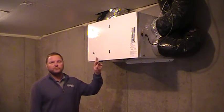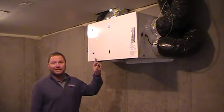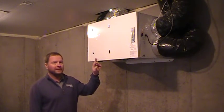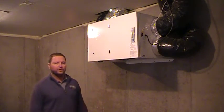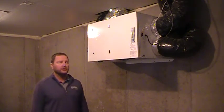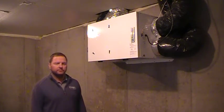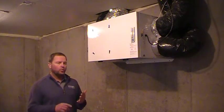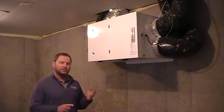This is the most important piece of equipment in your house — this is the lungs of your house. If you do not clean or maintain this, you basically constrict the air coming into your house through this system, and then you will have air and moisture coming through any imperfection, any hole or crack or crevice in the envelope of your house. The envelope is the energy efficient envelope — your insulation and poly plastic that holds behind the sheetrock.